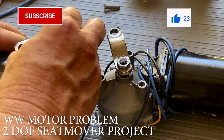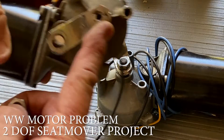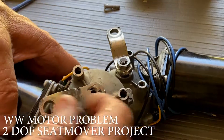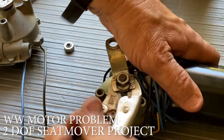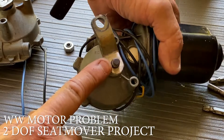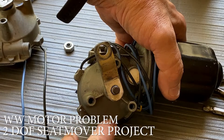So a little thing happened — I was tightening up the bolt and she just sheared straight off. So I had to tack it around here and a little bit on the bottom. After I did each tack, I cooled it down and made sure the motor was running. So this ought to be good. On this one, what I'm going to do is just tighten it down. I don't want this to happen again because that was kind of a pain. I should be able to tack it right here. I'll put a tack weld on, cool it down with a wet rag, and then run the motor once just to make sure everything is going good, because I don't want to run a whole bead around here. Live and learn.